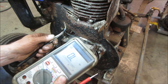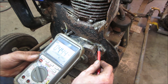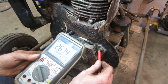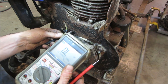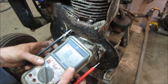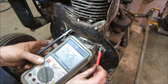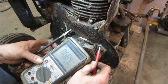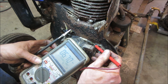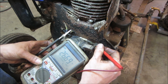All right, let's go see. The stud sticking out, that should be open and isolated, not grounded out. Same thing, that's up and really high. And then this one is the one that's going across the coil. So that one should have like 30 ohms maybe, is a guess. That's not good. That's the windings going across the coil. That coil might be open internally.